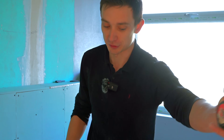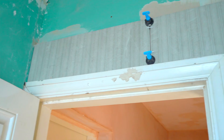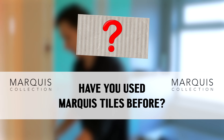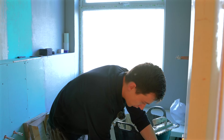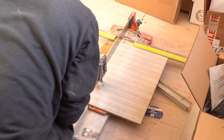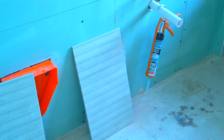It all depends on the room - this one has a door in the corner, but you'll still see a grout line in the top corner up here, so you have to make sure once it's come around it is all going to run around perfectly. The actual tiles - not these ones themselves, but similar ones I've used - are good quality and very hard, so you've got to use the correct bits to cut through them, but in general they're not a bad quality tile at all.